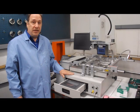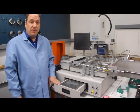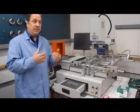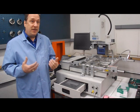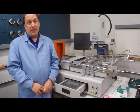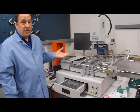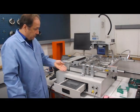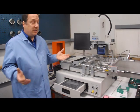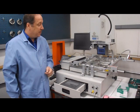The best thing about the machine is that it's small and totally self-contained. It has its own internal air, its own vacuum. It runs on a PLC — a programmable logic controller — and has a little touch screen on the front. Compare this to the industry standard, which runs between $80,000 and $100,000, weighs 1,000 pounds, takes around 30 square feet of floor space, and needs a 5-horsepower air compressor just to get the airflow through. The SV550 takes up about 9 square feet of floor space, weighs 200 pounds, doesn't need any external air, runs on 220 volts, and you can take it anywhere and plug it in.